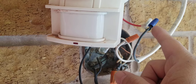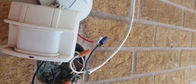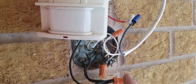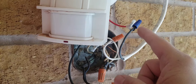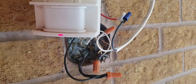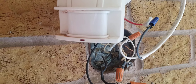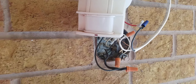When it comes out, it goes into the actual recessed light to give it power. The sensor is acting as a switch — it gives power and then switches on when the motion sensor activates. The power comes in and then goes out to the light, turning it on. As you can see, I'm right here so it keeps blinking on and off. That is how you install the motion sensor.